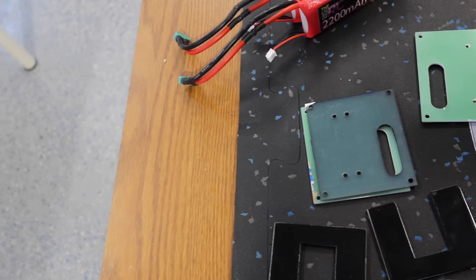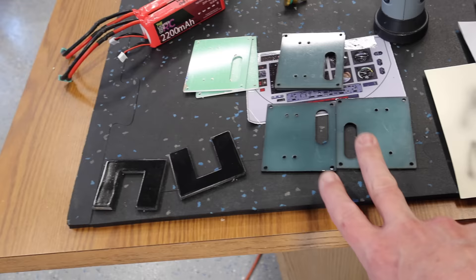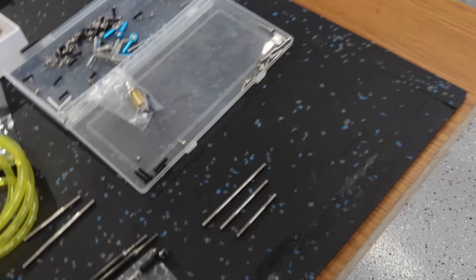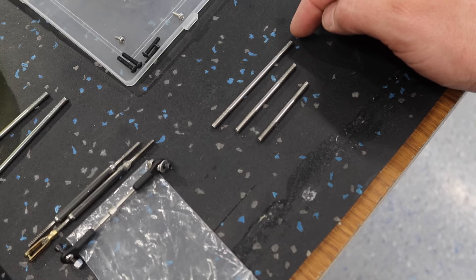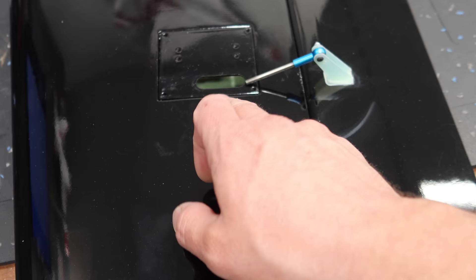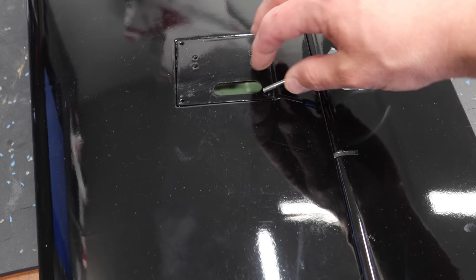Getting into the other surfaces - we're going to be using our G10 or fiberglass plates. We've got two whites and four blacks: two blacks going on the elevator, two going on the wing for the flaps. We have the L brackets to screw on servos - pretty straightforward. If you're building one of these: the longest control arms are for the rudder, next ones down for the flaps, next ones for the ailerons, and the shortest ones for the elevators. When setting up your plates, you have the output shaft closest to the control surface - that's because of the layout of the control rods. If you flipped them all around none of the control rods would work.